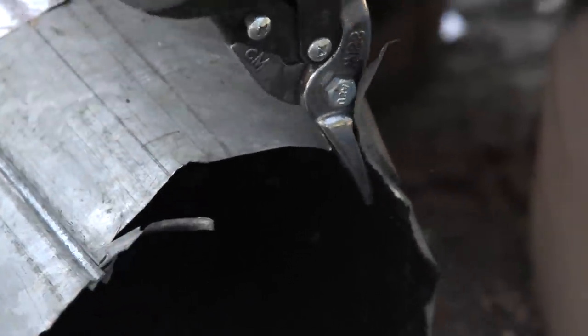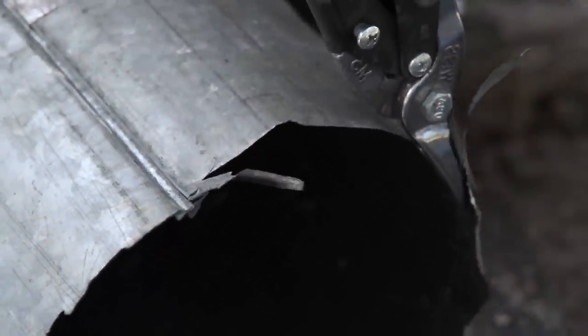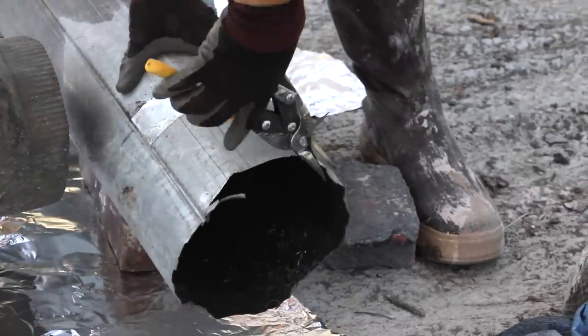If it's just two bricks you might get away with just a chisel or a brick set. A metal cutting blade for a circular saw is useful if you have to trim a barrel or something like that. For DIY people I usually try to steer them towards snips for cutting metal, but every so often you need to make a cut quick and move on. Metal cutting blades are a little scary for anyone who's used them for any length of time. A good cross-cutter ripping blade with carbide teeth for cutting pieces of wood to length is really handy and relatively safe.